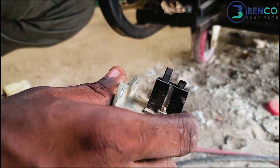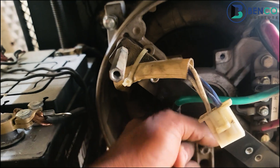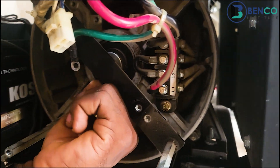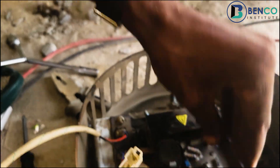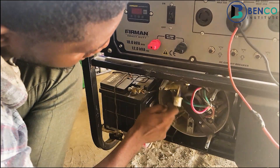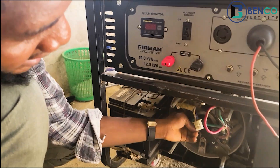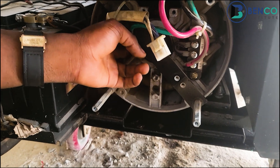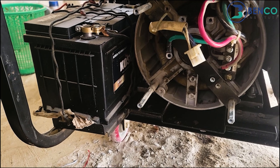Let me quickly touch the slip ring to see if the slip ring is faulty at any point. The slip ring looks good — looks like just the brush is faulty. However, just to be sure, I'm going to kick this generator so that the slip ring can turn a little. My hands can only touch this end of the slip rings and not the other end perfectly, so by the time I kick the generator, the slip ring should rotate so I can check the other edge to be sure it is smooth.